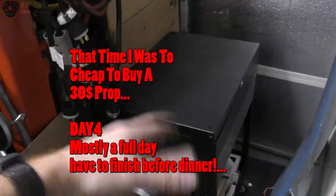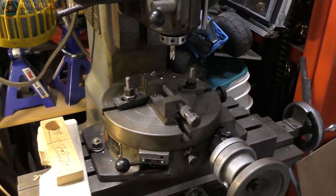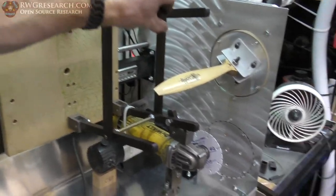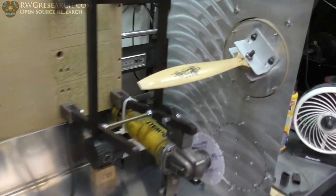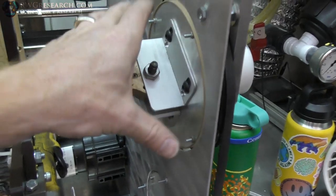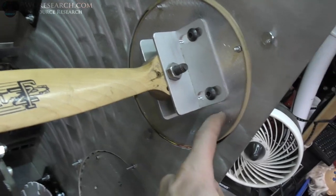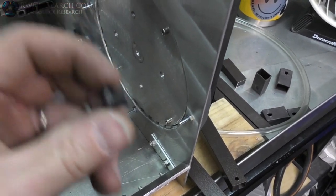Update: got the mill out, cleaned it off. I got all my mill tools in here. I milled and slotted and cut stuff. I got these little brackets made - slotted them out on the mill, cut from a full piece, drilled and milled slots. They fit on here so this allows movement this way with the center tapped and threaded on the front plate - put these little 5/16th bolts in.